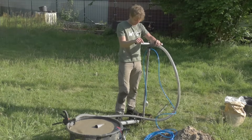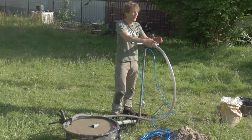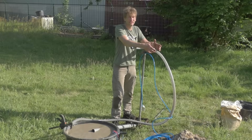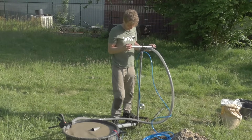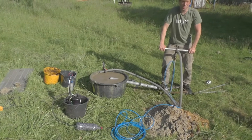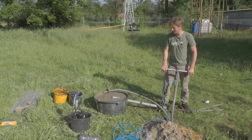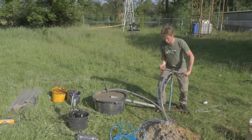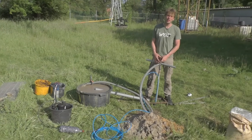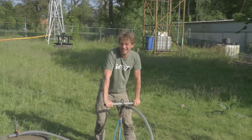We are now at four meters. With this pipe in, we have a hole diameter of 145 millimeters, but the size of the hole can be changed easily by changing the drill bit. The deeper you go, the heavier your drill unit becomes, so eventually it's almost impossible to lift and hammer it down alone. That's why there is a hook — you can attach it to a tower and people can help lift it with a rope. Up to 10 meters I can still do it on my own.